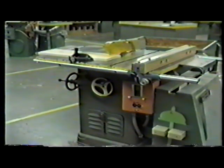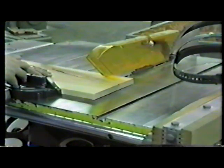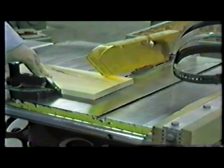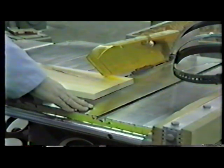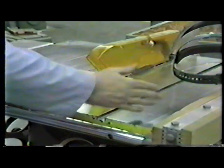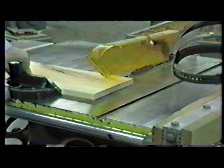Okay, now we're going to get ready to do the actual sawing. As we get ready to do our cross cut here, the table saw can be, again, a very, very useful item. You do have to be particularly careful of kickback. If you misuse a saw, or have an accident on it, it can be kind of on the negative side. Kickback is when the wood comes flying back. It will normally happen on this side of the blade, for the piece of wood that you're cutting off. It happens probably more often with ripping than cross cutting.